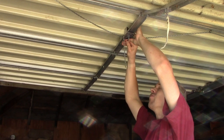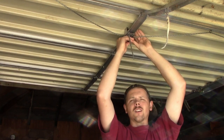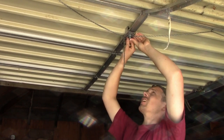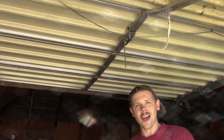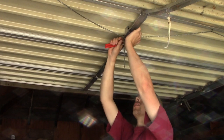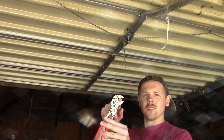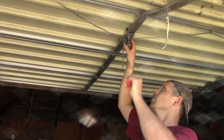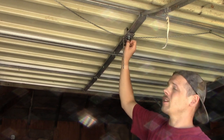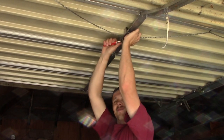And hope that the moon's at the right phase, the right amount of humidity in the air, the right temperature, the right zodiac sign — there are so many things that affect whether this works or not. Alright, so it's kind of on there. What I'm doing is using my pliers to create an opening that fits around that shaft so I have a little more surface to push on rather than just trying to use my two thumbs. You could also take a block of wood, drill a hole that the square shaft can fit in, put it over there and tap it on with a hammer — that's another viable option, but I don't have a drill on me right now.